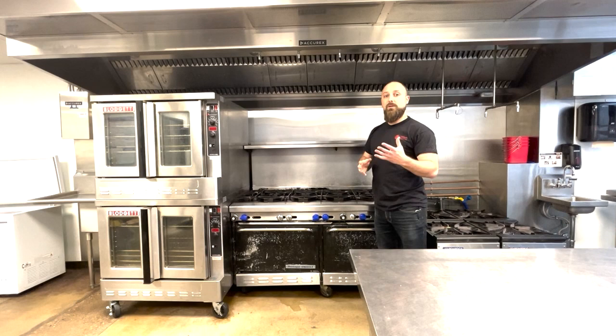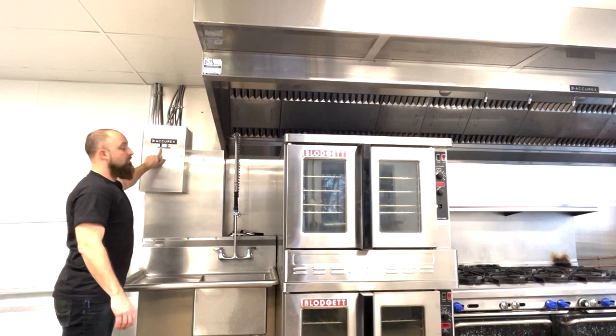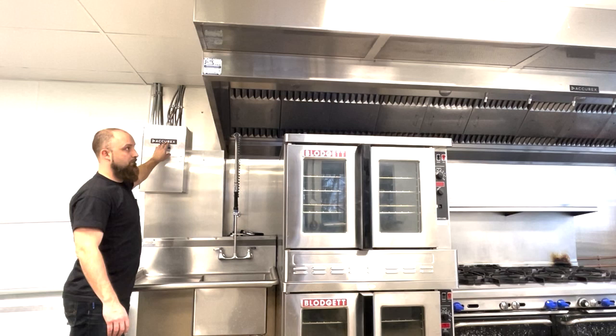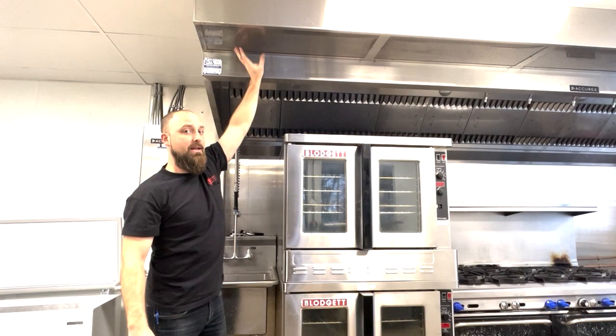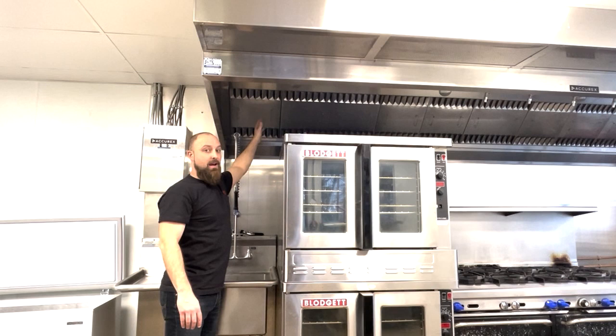The fourth thing we want to check is: do the fan and the light operate? Here we'll test the light and the fan for this exhaust hood. This switch controls the lights. As you can see, the lights don't turn on underneath the hood right now, but the fan does. You feel the air moving — you get sucked out. You feel positive pressure from the makeup air that also turns on. When the fan operates, you should be able to feel the negative pressure moving the grease-laden air out of the hood area, and somewhere in the space the makeup air turns on and creates positive pressure with fresh air.